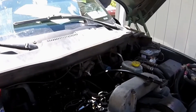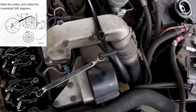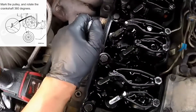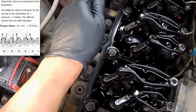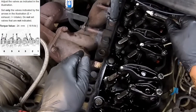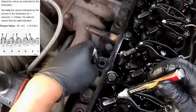We're going to bar over the engine about 360 degrees. Right now we're on top dead center for number six. Now that we know cylinder number six is at TDC, we're going to proceed by laying out our sequencing: intake, exhaust. Then number five — intake. Number four — exhaust. Number three — intake. And number two — exhaust.